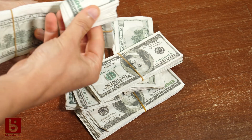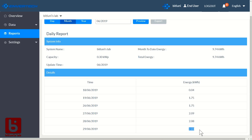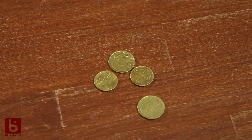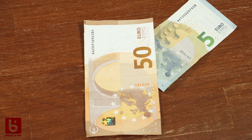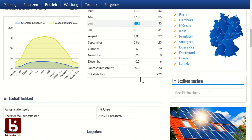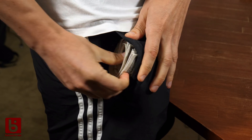Let me rectify your expectations a bit. At these best days of the year I was able to harvest about 2 kilowatt hours per day. That's at 30 euro cents per kilowatt hour, 60 cents a day. That seems disappointing, but if you consider that it's running 365 days a year on its own, that sums up. Online calculators help to figure out how much you can harvest a year and how long it takes for the installation to pay off. I got 2 kilowatt hours a day with this good weather; the average in June seems to be 1.2 kilowatt hours here. So the installation will pay off after 5 years. Every cent of the 15 years additional lifetime after that will go directly into my pocket.